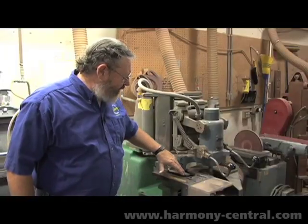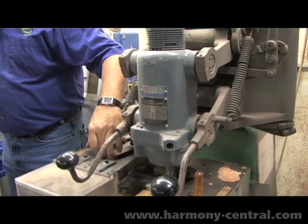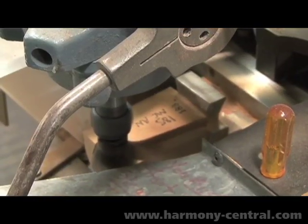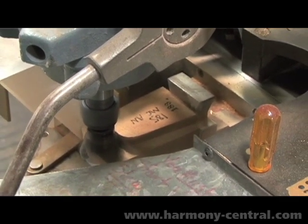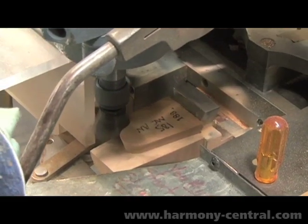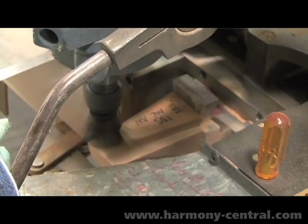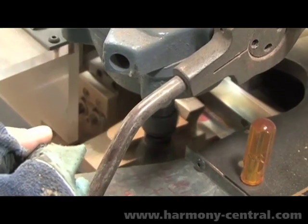There's a pattern here of a dovetail in steel, and we run a stylus around that, and it transfers in a pantograph cut to the neck that's positioned below. The neck's angle is ensured by attaching it to a plate, lifted out at the optimum degree to meet our body, which we call 3 degrees, and in reality is a 2.7934, something like that. But we call it 3 degrees.